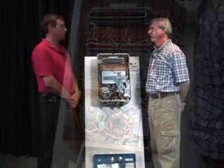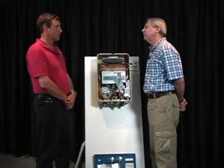Dave, can you talk a little bit about the differences between a conventional water heater and a tankless water heater? Sure. A tank-type water heater has some amount of storage, 40, 50, 60, up to 100 gallons. And what's happening with a tank-type water heater is that water's being heated all the time, 24/7, which is why people are going to tankless water heaters, because of the energy savings, primarily the space savings, the lack of maintenance, the lack of having to schlep a water heater up out of the basement every 5 or 6 years, lack of sedimentation that we talked about, and primarily the lack of running out of hot water, which is what you see typically with a tank-type water heater.